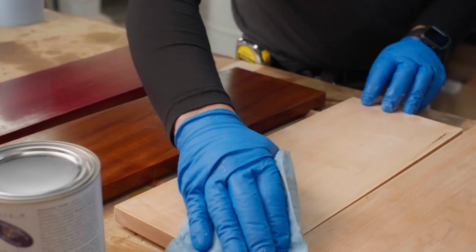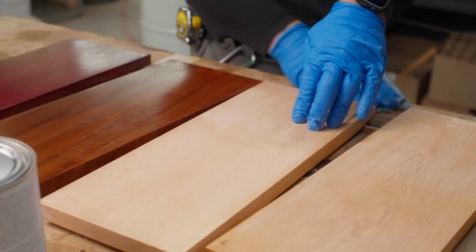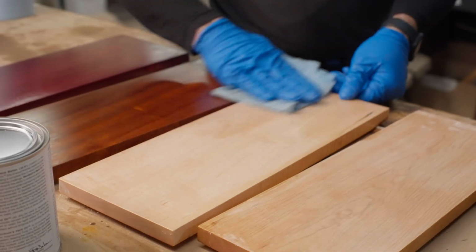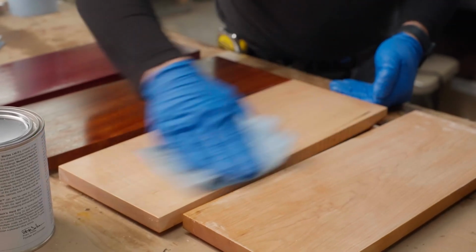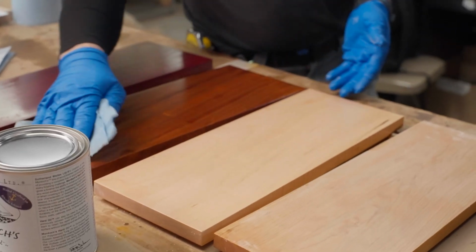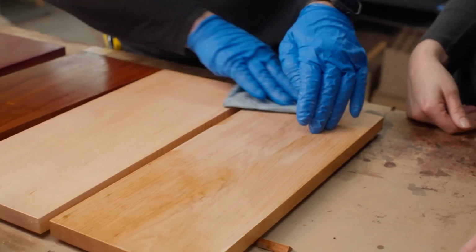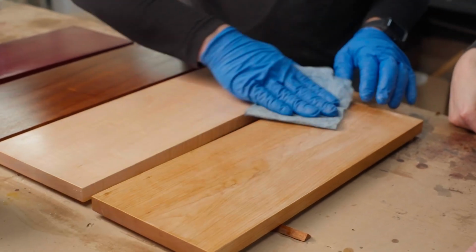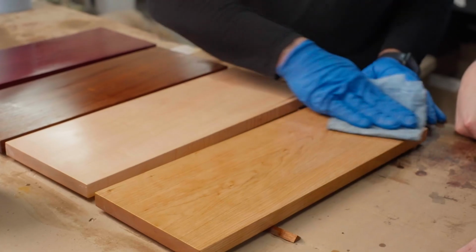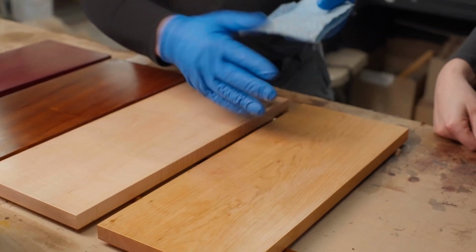Yeah. And can you use it without the hard sealer as a base coat? Or do you want all the oil that the hard sealer has in it to give you all the good stuff? In a pinch, I've taken the hard oil and added a little bit of mineral spirits to thin it out a little to get good absorption. You could certainly do that.